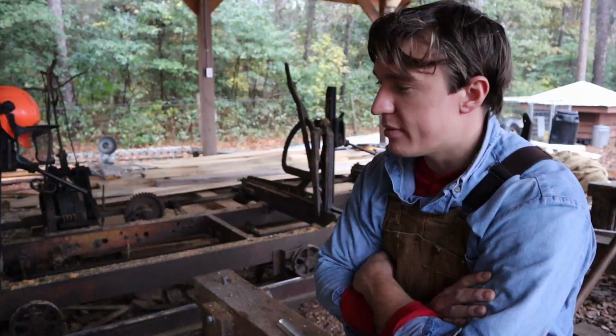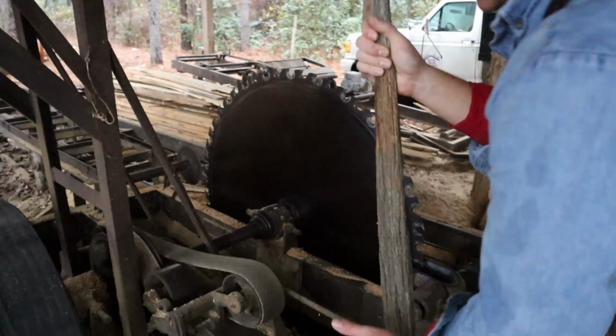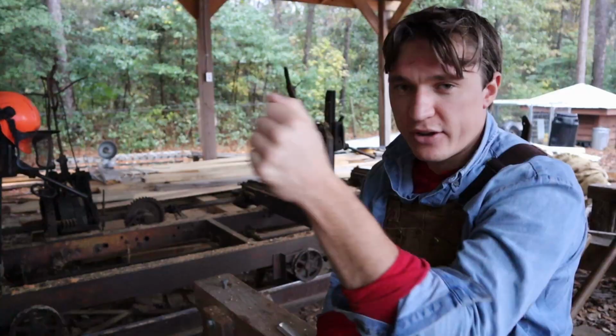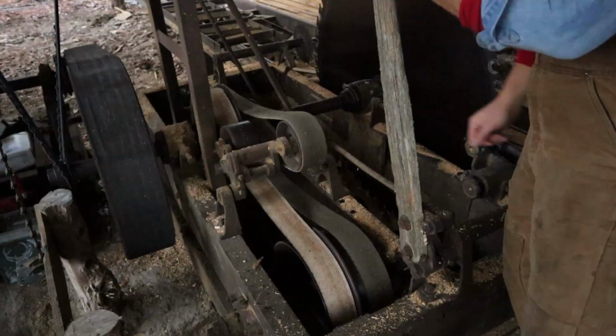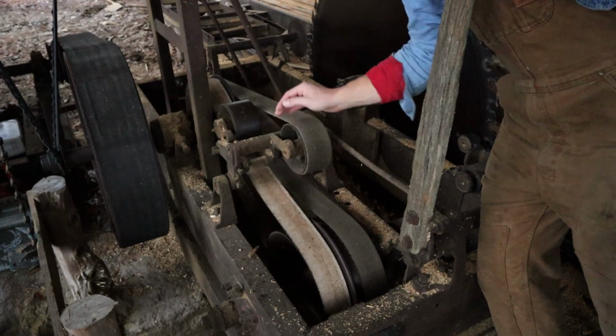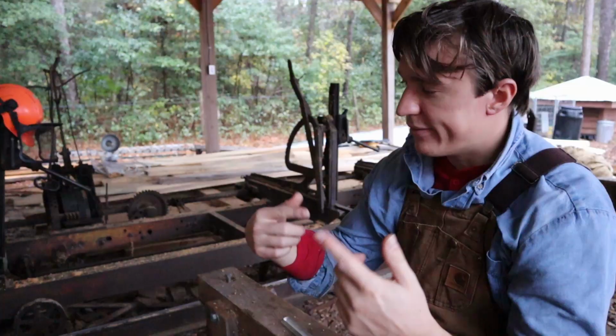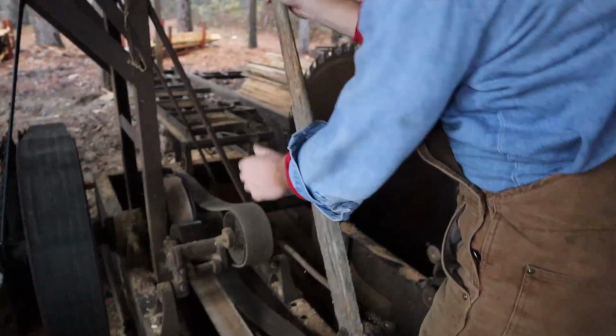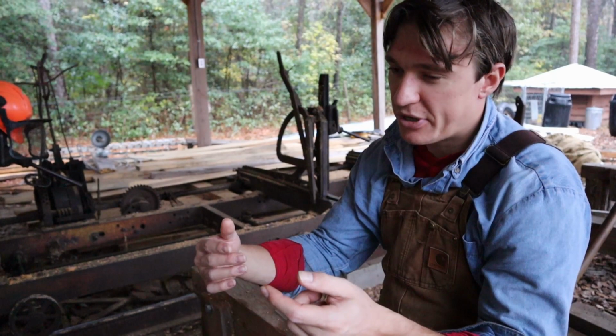The main thing is to be able to drive the carriage into the saw. It's hooked to a lever system that's brought up to a stick that I can control, pushing and pulling. When you pull on it, it pushes a lever that pulls the belts tight around the mandrel and spins it, I don't know if clockwise or counterclockwise, in such a way that it turns a big drum where a cable's connected to the carriage and pulls it into the saw. When you get to the end of the cut, you push it, it takes the tension off that belt so it quits turning the drum that way, and engages other belts to turn the drum the opposite way, and it brings the carriage back.